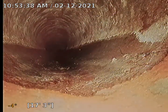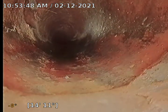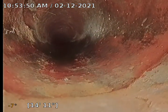We've located this — you're on the driveway side at two feet six inches. I'd recommend installing a clean out right there so you have future access to the pipe. There's another minor intrusion coming up on the left hand corner. That looks like where the possible kitchen line ties in. Now we're coming back into cast iron.